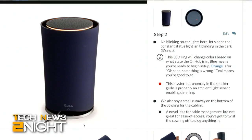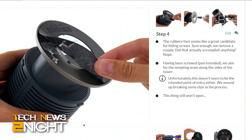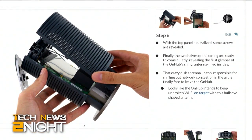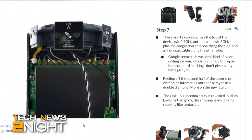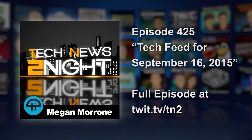Eventually they'll update that and it will run not Zigbee but Thread, which is Google's smart home protocol built with Nest. When they finally launch a smart home platform, all of this stuff will run the Thread protocol. Brillo is a separate thing — it's an operating system. Thread is kind of a replacement for Wi-Fi. Wi-Fi is battery-hungry and really fast, but for smart home devices you want something that sips battery and is slower, because you're only ever sending messages like 'unlock the door' or 'turn on a light bulb.' Brillo is the Android-based operating system that these smart home objects will run — your door lock or light bulb will run Brillo on cheap embedded processors.